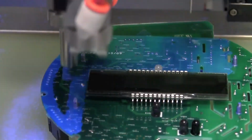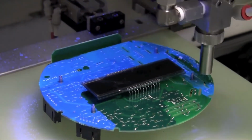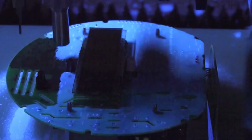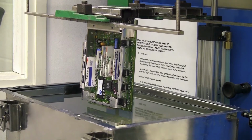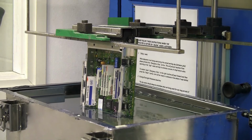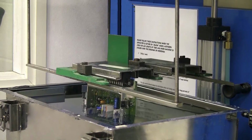If you have a bit more of a budget, we would usually advise that application should be performed by machine. This will eliminate some of the issues found with the methods mentioned already, and a greater level of accuracy can be obtained. There are 2 main methods. The first of these is dipping, whereby the board is slowly dipped into the coating. This is a slow process, as the solvent evaporates as the board is withdrawn. Therefore, withdrawing too quickly can cause streaks in the coating.